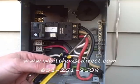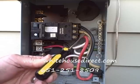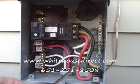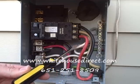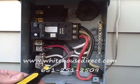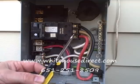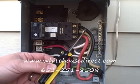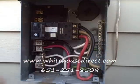You'll notice there are three wires: there are two hots — each is 110 volts — and this is a neutral wire, which is what controls the GFI. The neutral wire should always go directly to the hot tub, and in our tubs it goes directly to the hot tub. This pigtail — the curly-Q one — goes over here to this bar, and that comes attached to the breaker. Most breakers have all three of these connections on the top, though lately I've seen many where the black and red are on top and the white is in the back next to where the pigtail comes out.